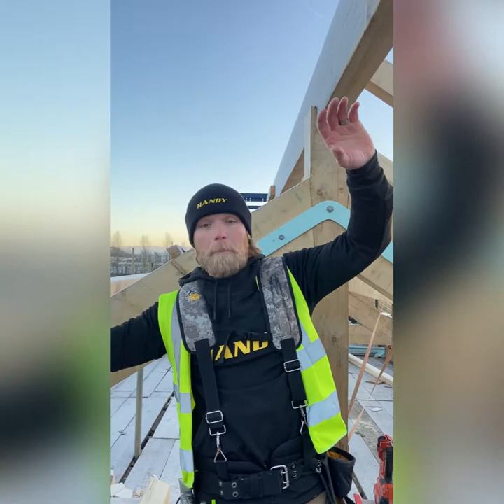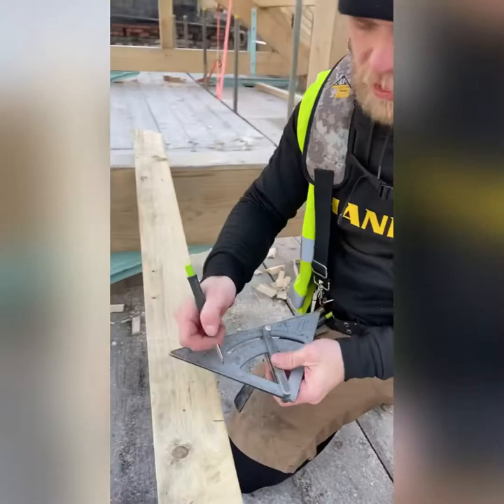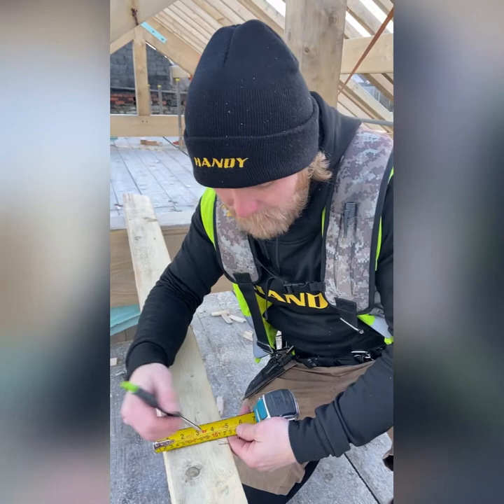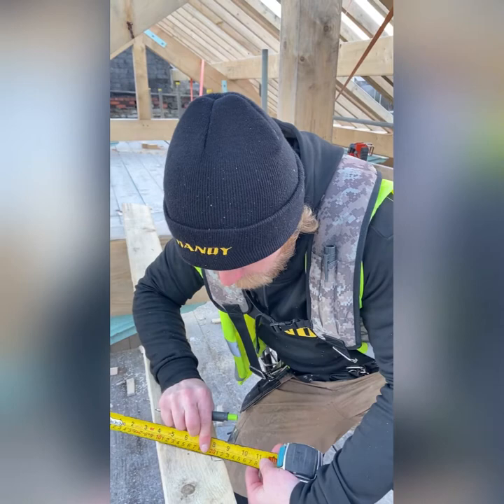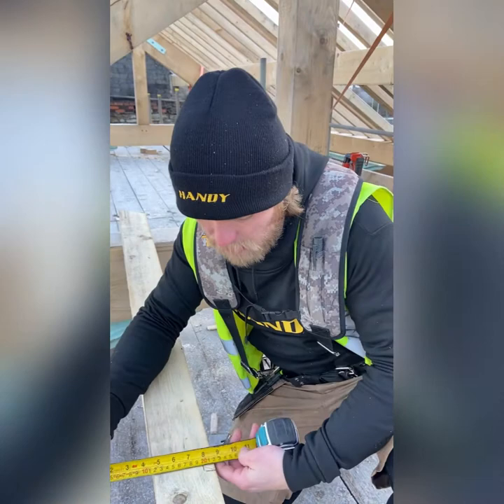This is our wall plate — imagine going from a wall plate to a ridge. From that point on the corner where the plumb cut intersects, mark up your plumb cut, then mark your 20mm with your tape square with the timber — not parallel with the plumb cut line. If you go off the plumb cut line you're encroaching too far; it comes out at 23mm. When you pivot your tape to square it increases the cut size, so make sure you mark square so you've got exactly 20mm.